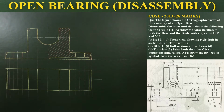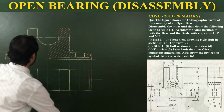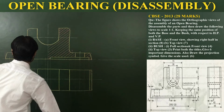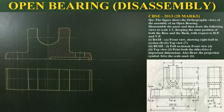Okay. Then last, the rectangular cavity. Now for the rectangular cavity, these are limits after 8, and okay, this is missing. So for the rectangular cavity, we know that it's a combination of two rectangular cavities, 8, 4, 4, 8, and from the side view again the distance is 8. So from this corner, from the rearmost edge, 8, from the front edge, 8, and this is the limit after 8.